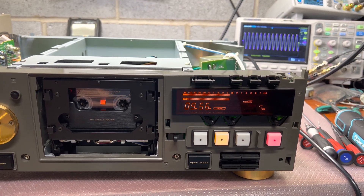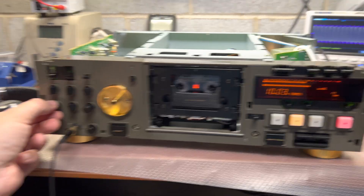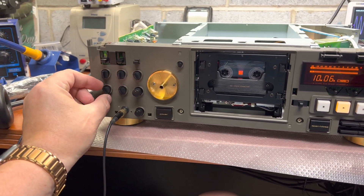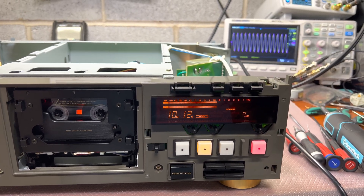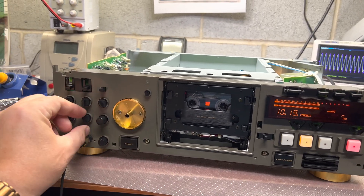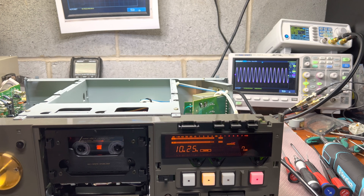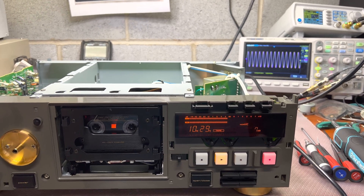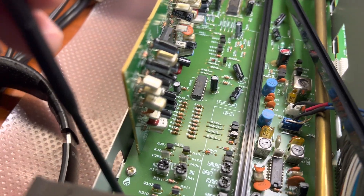And it's two decibel lower. How much do I need? I cannot compensate, you see? It's fully at top and I still cannot compensate. So, source versus tape — I'm minus one decibel. And if I return to the middle and switch source and tape, it's two and a half decibel difference. That's where adjustments would be needed. You always adjust this at zero decibel level using these two ports here.